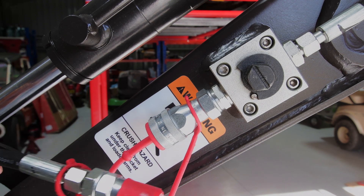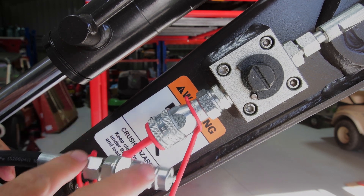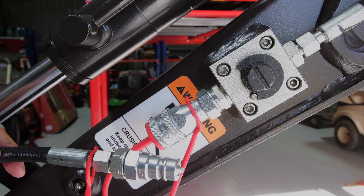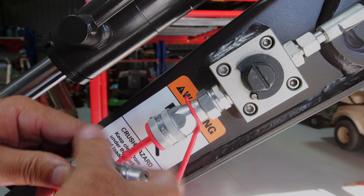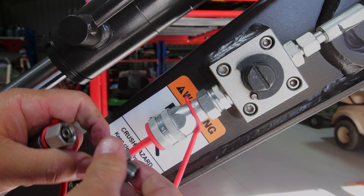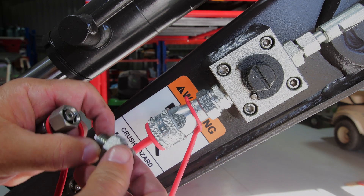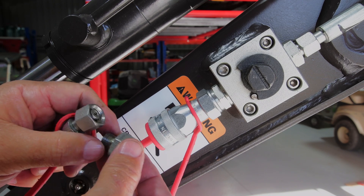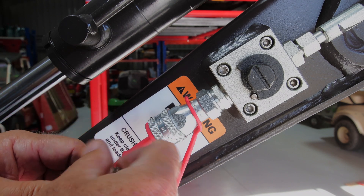So what would happen if you have another attachment — in my case I've got an auger drive, so I've got two of these pipes that come from the auger drive motor, one to this side and one to the other side. On my tilting bucket, what I would have to do is go and buy another two of these male connectors and another two of these nipple couplers that had BSP on one side and eight metric light on the other side. These weren't really common — when I went to the hydraulic shop they don't do a lot of these, so I had to get them to order another two in for my tilting mud bucket so I could put it on the pipe and have that ready to go.